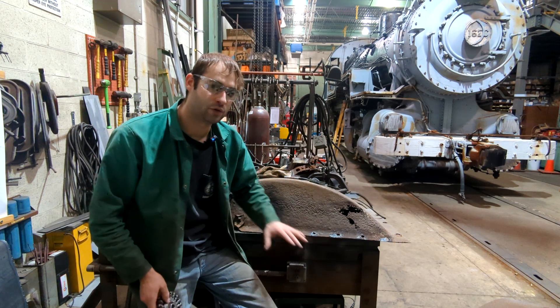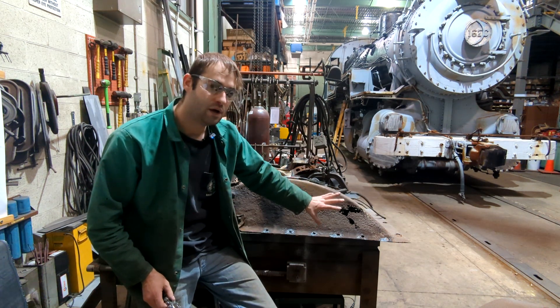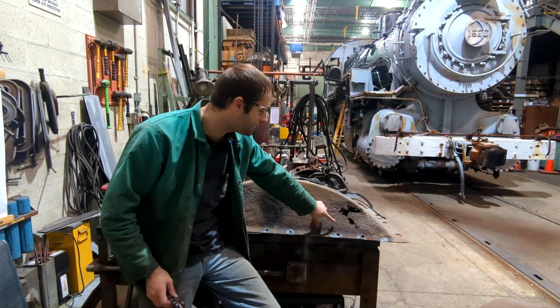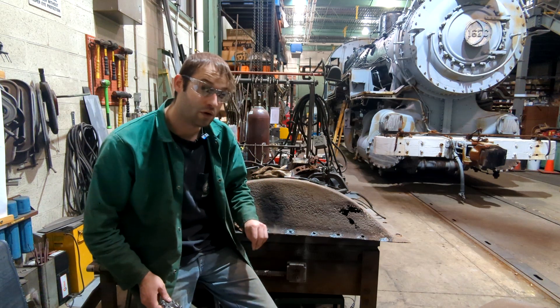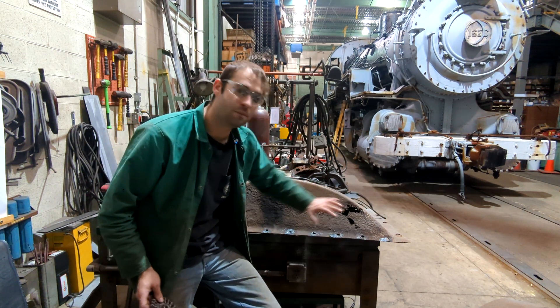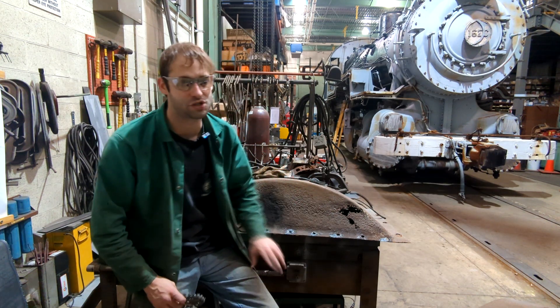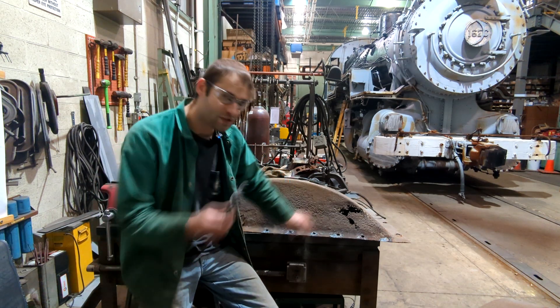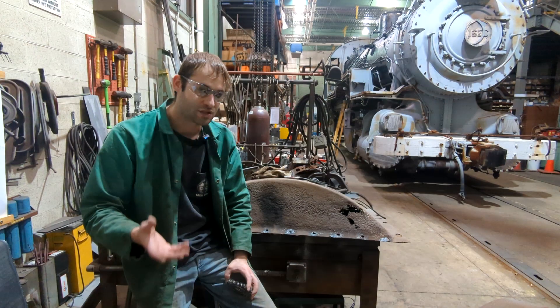Sometimes on a piece of metal you don't want to take any more away than you have to. On this one it's not a big deal because the contours don't change much, so I could cut a little further out to get to nice metal, which is pivotal for welding. If you don't take enough metal away and you're welding over thin metal it's just going to blow through again and take twice as long. Another technique I'll put up on screen is sandblasting — you can sandblast the metal and it'll open up holes you couldn't see, which is another good technique.